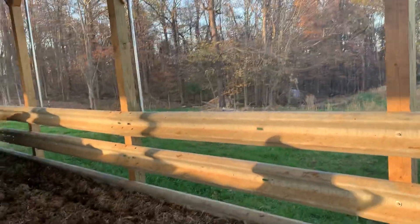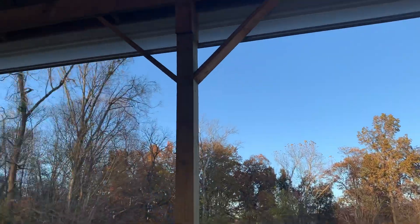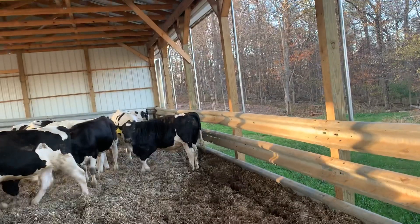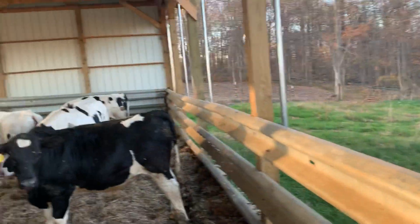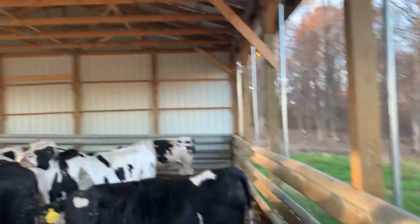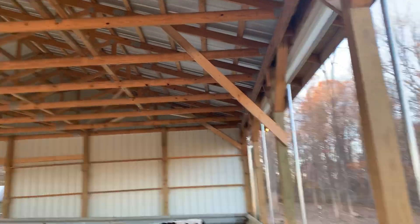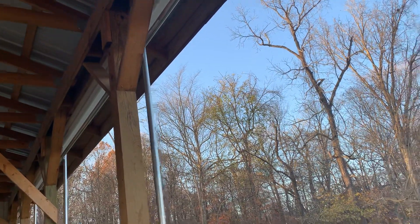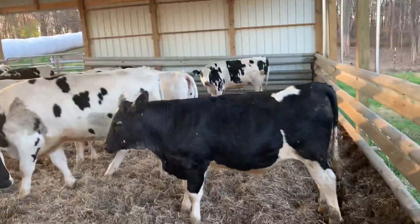I decided to do the guardrail — I was going to pour a four-foot concrete wall and put the post on it, but that was pretty pricey. So I ordered my posts on 10-foot centers. By the time I got the barn done and priced the treated lumber, it was about the same cost as using all guardrail, so I used guardrail. I still have to get a few bolts in to hold it up. It's a 35-foot truss with a two-foot overhang, so 39 feet total. I should have had a three or four-foot overhang to deal with rain blowing in sideways. This is a pack barn.